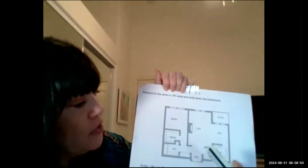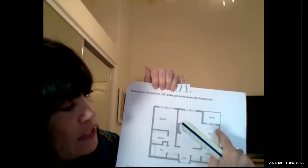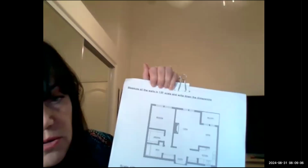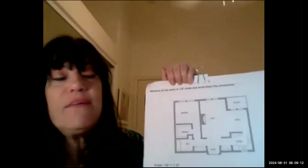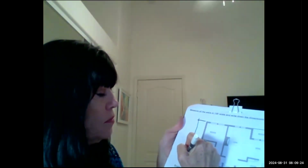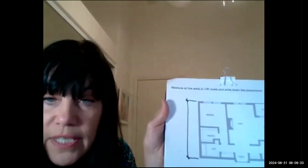So there are architectural things going on. Front door, a little window. Then you come around here, there's a nice wall, but then it jags into a window. There's a balcony there. And then that wall continues with 2 windows. And then here it's just pure wall. So when we're measuring the outside of a home or any space, we create extension lines. So we're going from the outside of the wall to the outside of the wall. These are called tick marks, little diagonal pieces. You want to measure from the outside to the outside and put your dimension there in feet and inches.